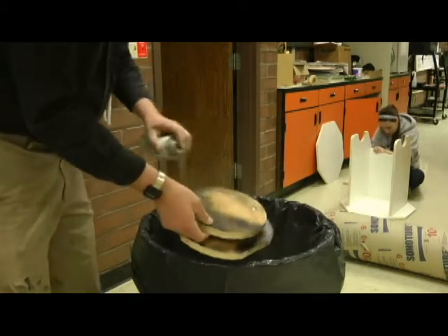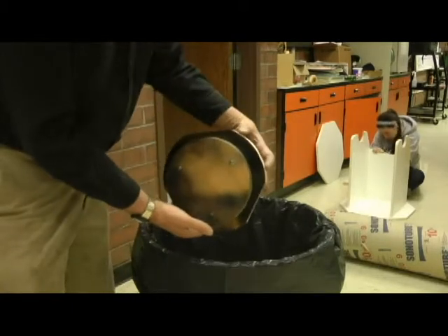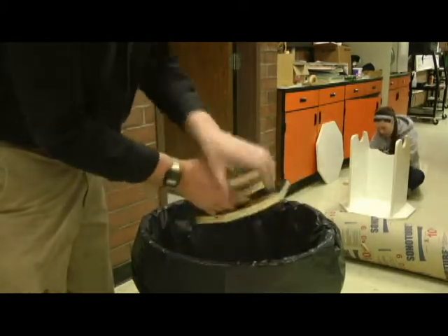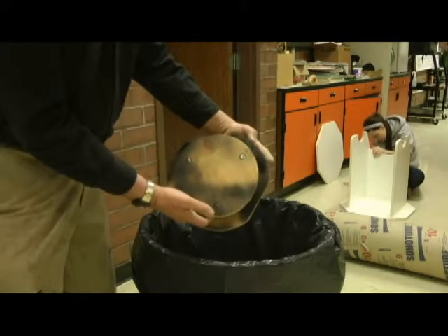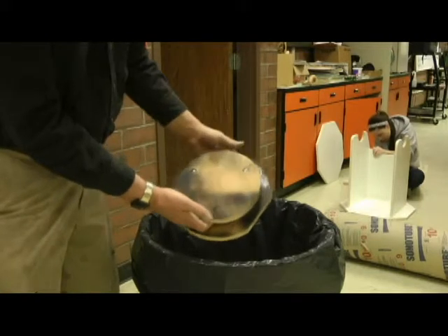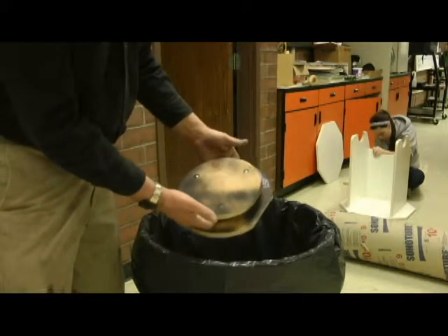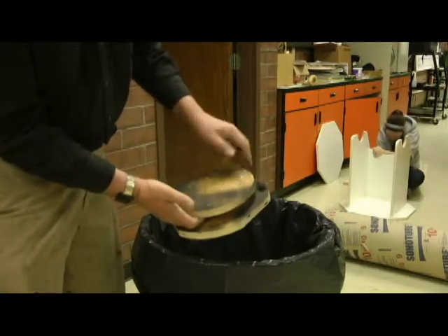Now when we mount that mirror inside the base of the telescope, we've got a section that's flat. On each one of them we'll put six screws into the tube itself as we adhere those in there. We've also got some vents cut so that the temperature can equilibrate as the air passes up through the telescope itself.